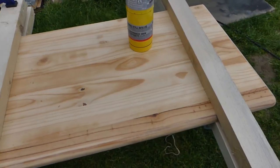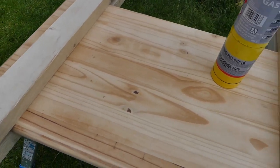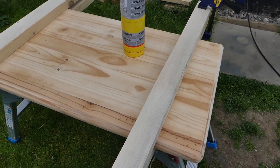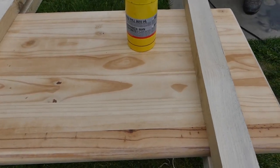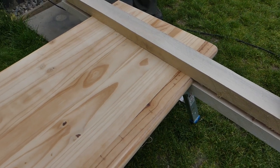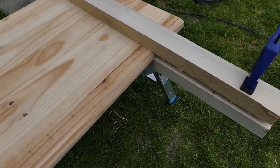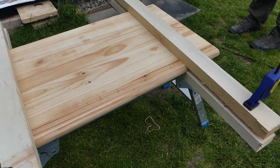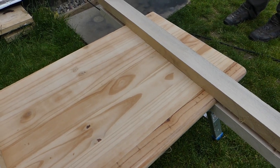Because it's quite a big piece and it's quite thin, we had to put it into some kind of straightener, I would say, because with burning, obviously you've got different elements like heat involved and it might cause the wood to twist. So to avoid this, we have to put it into this construction and we're gonna leave it like that after we burn, till it cools, and then we're gonna dismantle this construction.